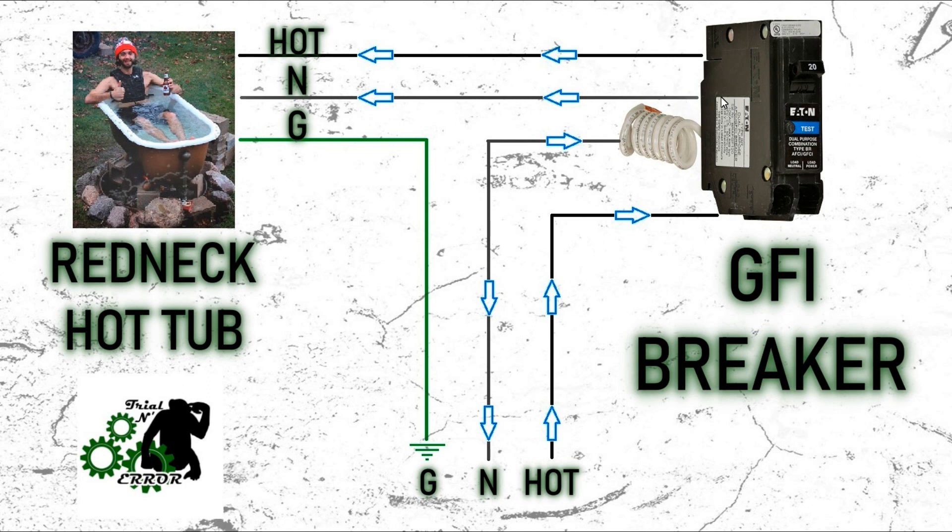It is constantly measuring those two to make sure they match. If they do not match for any reason, it will trip immediately. Some reasons that could cause that include a ground fault — some of the hot feed coming back through the ground line — and that breaker is going to trip. Another issue would be, say, the hot lead leaking into the water of the hot tub, which then goes through a person's body. The breaker will notice the difference between the outgoing and return current and will break the circuit. So if somebody were to throw a hair dryer in the tub, before it had a chance to do any damage, this circuit will automatically break because it sees a higher load on the hot line versus the return line.